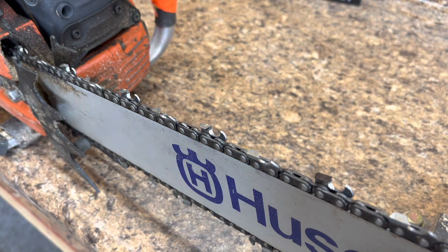That is all sharpened. I've sharpened this chain a couple of times now and have never taken the rakers down — and you can have the sharpest chain in the world, but if the rakers aren't adjusted right or if they're too high, it ain't going to matter.